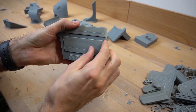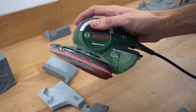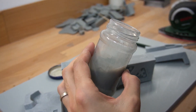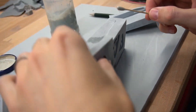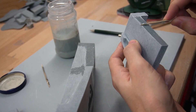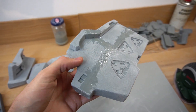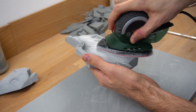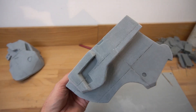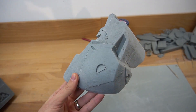Next, I had to remove all the support material. These can pop off and fly around pretty aggressively, so make sure to use clippers and eye protection. Now it was time for some sanding — for the first pass, I like to use this little triangle sander, which will get rid of any remaining layer lines in lightning speed. I actually used all the support material from before and melted it in acetone to get this gray ABS slushy. This works perfectly as a glue for your 3D prints. Just use a toothpick, smear a bit of it onto your seams, and press your pieces together. Then wait for a couple of minutes and your pieces are welded into one. I also put a little bit more on top to completely fill out the seam, but this meant I had to sand it smooth again afterwards. Using these same steps, I worked my way through this shoulder puzzle piece after piece until all of it was put together. It's always great to see a 3D model that you've spent hours making on the computer come to life right before your eyes.